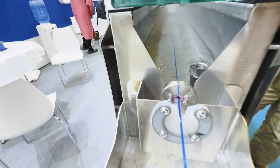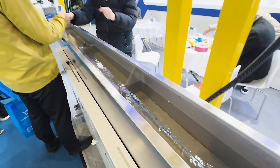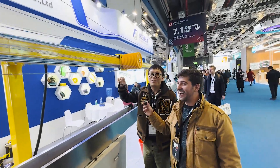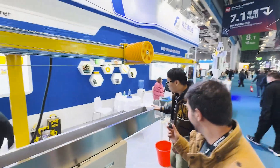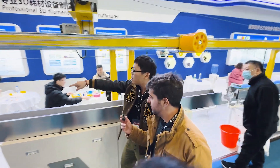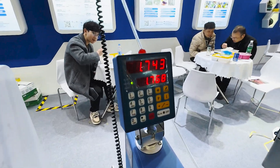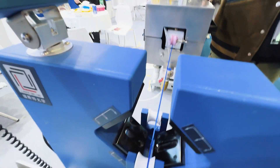After the warm water chamber, this one is room temperature water — still hot water coming in. And here comes the diameter control. We have four sensors — basically one, two, three, four — measuring in two directions. With two directions we can measure the roundness of the filament, because sometimes it could be oval. You have to be careful of the tension control here — if someone mistouches it, it will be affected.